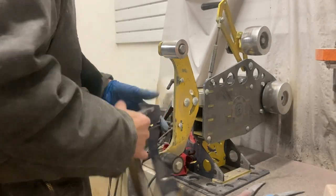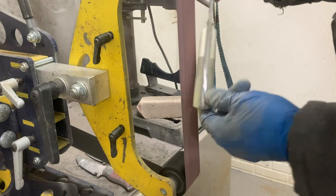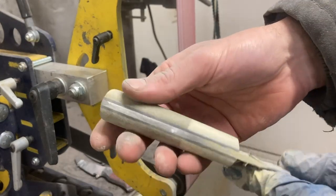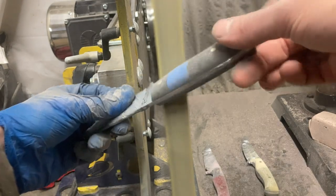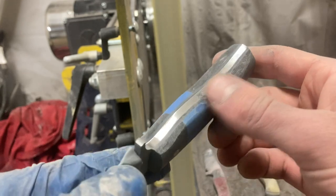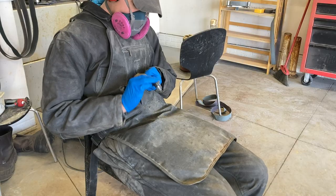After the rough contouring, I remove the flat platen to give me a slack belt, put on a 120 grit belt and do some more blending. The last thing I do before hand sanding is use a scalloped 1x72 J-flex belt — this belt has a ton of give and flexibility which enables me to really blend all of the contours together really smoothly. On one side you can see the unblended side, and on the other side everything is nice and blended. With all three handles roughly shaped, it's now time to start hand sanding through a grit progression of 320, 600, 1000, and 2000.